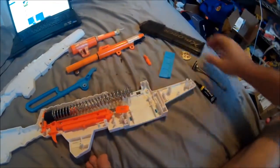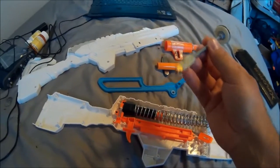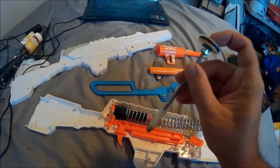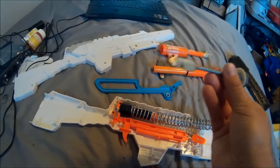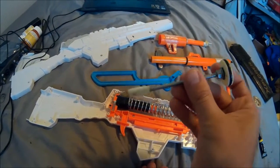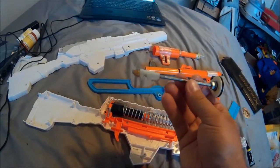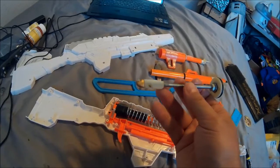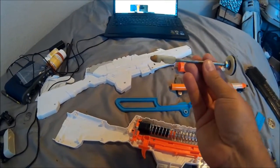And finally, I think what a lot of people are waiting for, the plunger rod. That's right. That is my Sentinel plunger rod right there, completely different. This is my first prototype I made. There's a few things I might do different this time around. The next one I make, either one, I'm going to go to a number 8 rod rather than a number 10 rod, or I'm going to go grade 2 titanium, because this is quite a hefty piece of metal right here. However, this works absolutely perfectly.